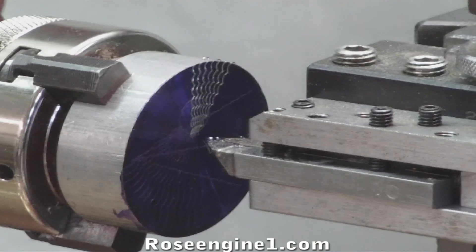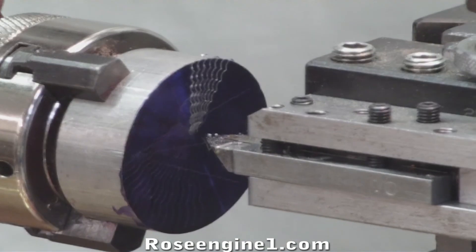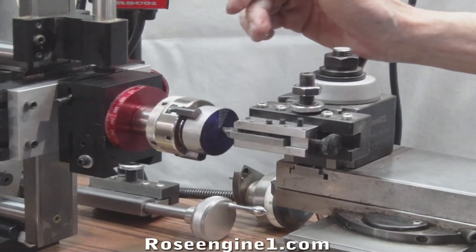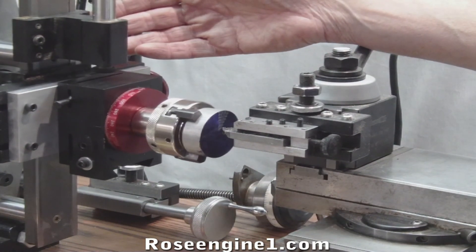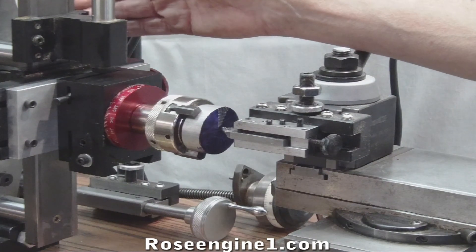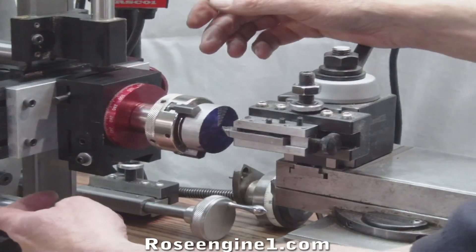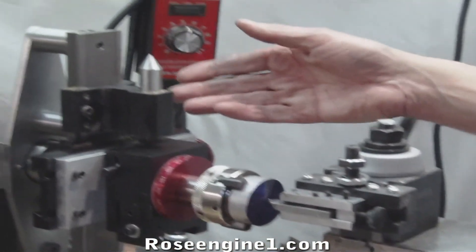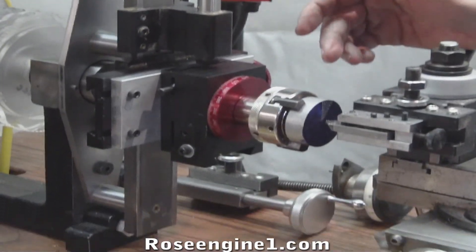You can see that I'm stopping in the same center every time. All I've done is take my tail stock, turn it around, and tighten it exactly where I want on my part — when it bumps up, that's my stop. That's my stop for my centerline. I can also use the riser, which comes with the Sureline products, and put a riser down here so now I have a stop on both the up and down motion, especially if I have a border.